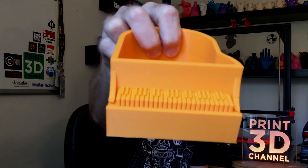We downloaded this from MyMiniFactory and once we had it downloaded we sent it over to Simplify3D for slicing. In Simplify3D we used a 0.2 millimeter layer height with four top layers, three bottom layers, and three perimeters. We also used only 10% infill on this model and we ran it at 45 millimeters per second. With all those settings the print turned out pretty good.